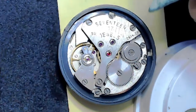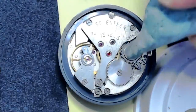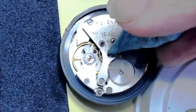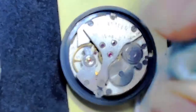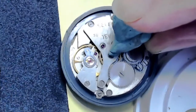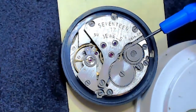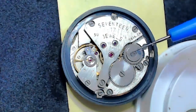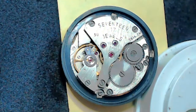I'm going to take a piece of Rodico — that's Watchmaker's Putty. You just dab it on the jewel, turn it a bit, and you can remove that oil using Rodico. Then fold the Rodico over, make it into a point again, and dab again. You do not want too much oil — if you put too much in, that oil will ride down the jewel, then down the shaft of the center wheel, get into the pinions, follow through the watch, and collect dust.